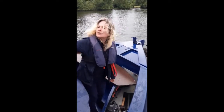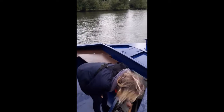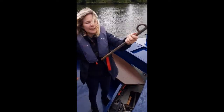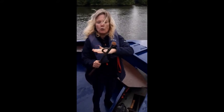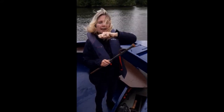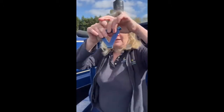Do the same for your stern rope, and if you're mooring overnight or leaving the boat you'll need your centre rope as well — so you'll need the third stake for that. Again, always at an angle and always all the way in so only the eye is showing. This little tool is your water key: this end goes in the water point to unscrew the cap, and this end goes in the pump out to unscrew those caps.